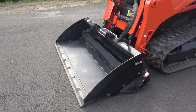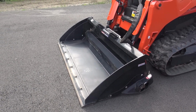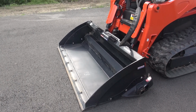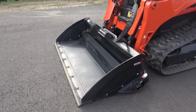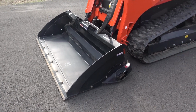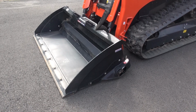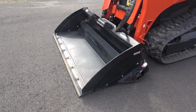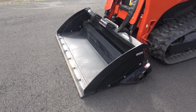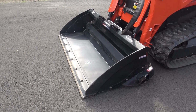So a lot of times, when I buy an implement and have a question, I usually like to talk directly to the manufacturer, the people that actually built the product, to see what they had in mind in certain areas. Like, how much grease should you put into each side of the rolling drum? Is it 3 pumps? They said, well, I would have normally done 3 pumps, but the answer is 12. But that's why I talked to the manufacturer.